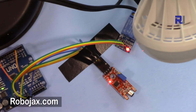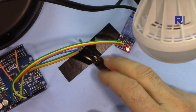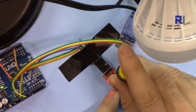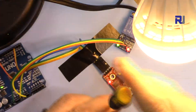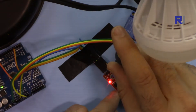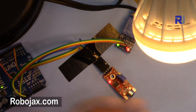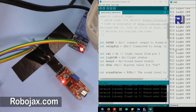Now we are using the advanced mode. Instead of the digital pin, we use the analog output — the last pin on the module. To calibrate, first rotate the potentiometer counterclockwise until you hear clicking, then rotate it clockwise until it stops. After calibration, you can trigger the light by clapping or raising your voice: light off, light on.